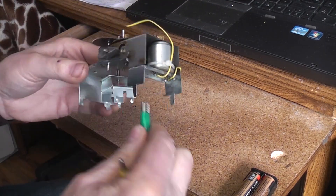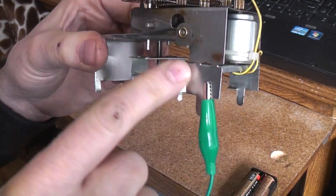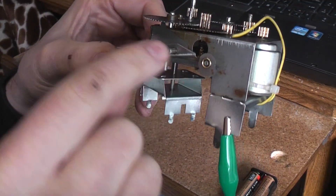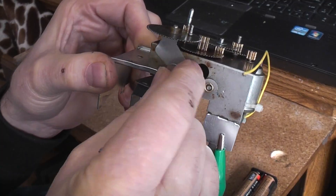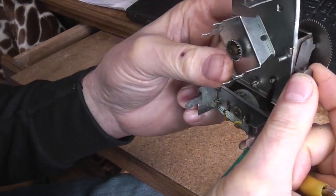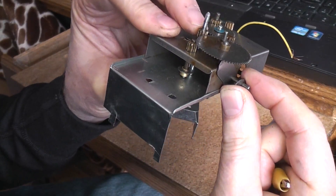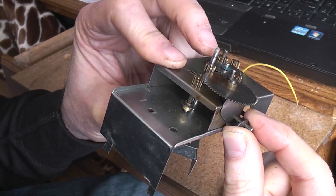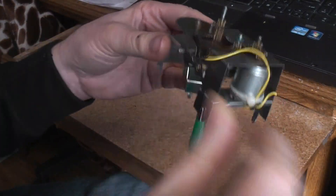Another popular way of shifting functions with one motor that's simply on all the time is to use a cam. Right here there's a small cam and a lever, and the lever pushes on a gear to raise and lower it. When this gear is all the way down it engages a bump-and-go drive. When it's up, the bump-and-go drive stops and it engages another shaft which runs a noise maker, a light flasher, and a drive that goes up to the head to spin antennas and rotors.